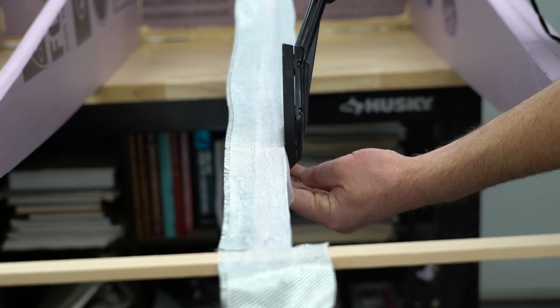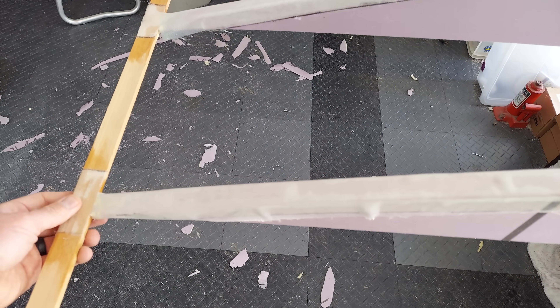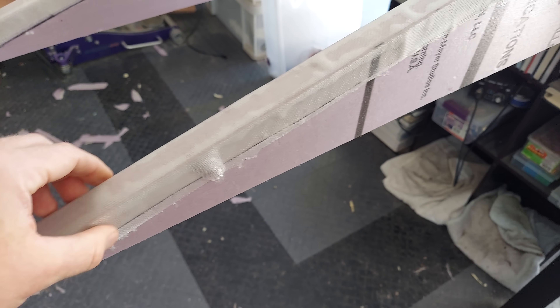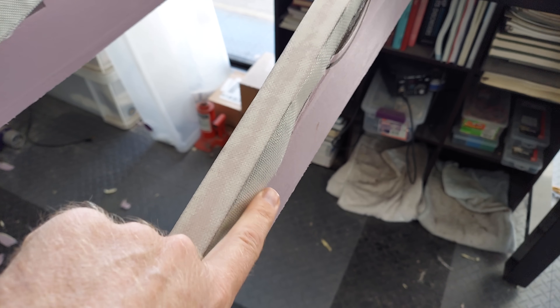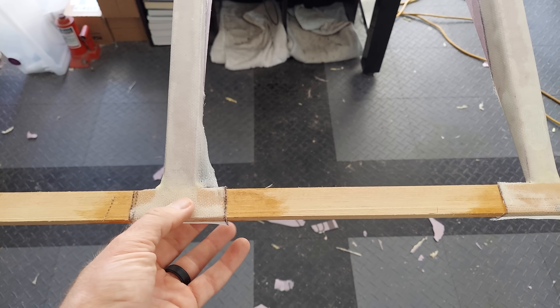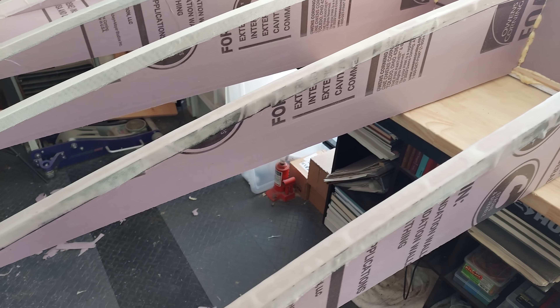The last video left off with the top cap strips being ironed in place. After that they received some epoxy, and a lack of vacuum bagging caused some issues. The 3M77 let go in some areas when the epoxy hit it — that's really going to reduce your buckling strength. In some areas it released completely, nothing on the underside. That's what happens when you do not vacuum bag anything. Unwelcome but not unexpected result.